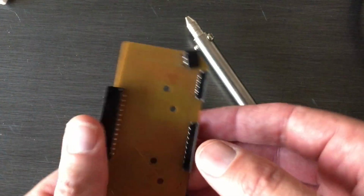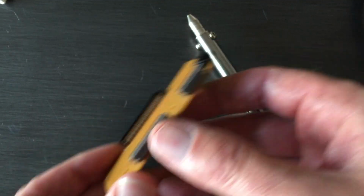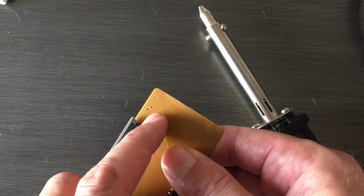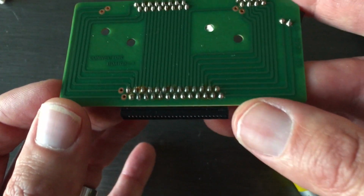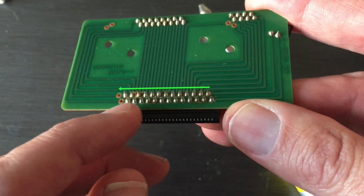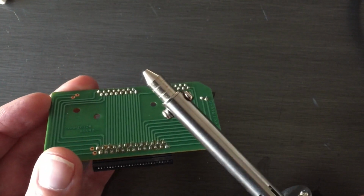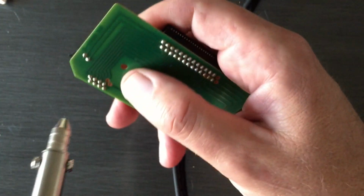All right, so I'm going to take this board out and flip it around. And I'm also going to take this little part, this is where the aftertouch ribbon goes, and I'm going to put it over here into these pins. And when it comes to where these pins go, in flipping it around, everything's going to move over one. So here goes a complete novice. I'm going to use a solder sucker, brand new solder sucker. Hopefully I won't mess this up.